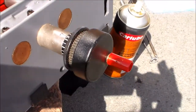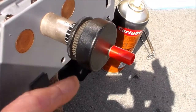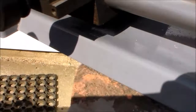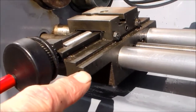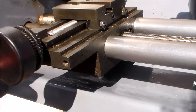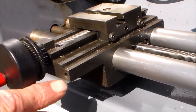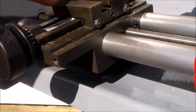Just while we're here, you can see the tooth part on this hand wheel, ready to attach a tooth belt onto some stepping motor. And again, on the cross slide, you've got a couple of tapped holes in the ends of it and the tooth section on the hand wheel — that's for attaching the bracket which holds the stepping motor for this movement across here.